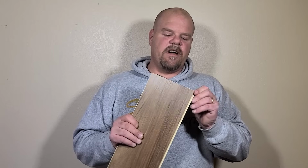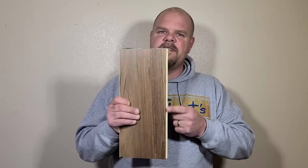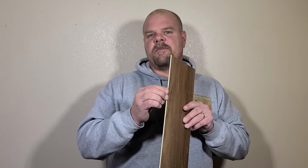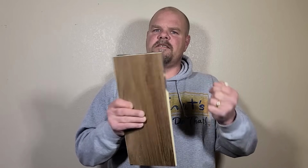Now, this is a vinyl plank that has, so the groove is actually what's going to get weak. Maybe not so much the tongue, okay, but the groove. I mean, these things break off really easy, so you can see what I'm saying. If you put too much stress on that, you can break and crack these joints after a while, and then what's going to happen is you're going to have loose joints, okay? Planks will start to come apart, or if they don't, they'll maybe get hung up on each other. You'll start seeing gaps.